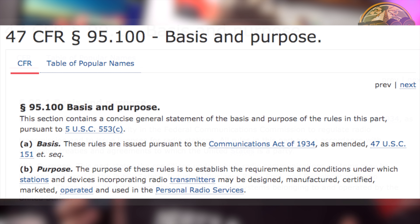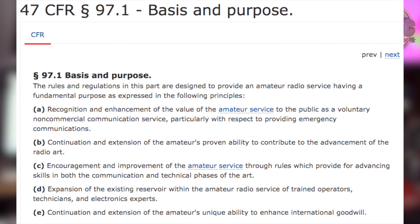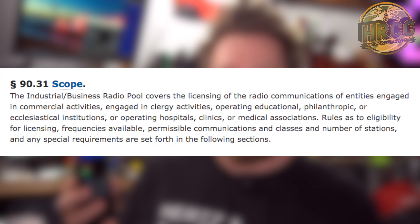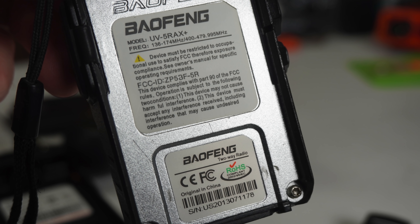Radios like this one are Part certified by the FCC. Part 90 includes land mobile radios. Part 95 is FRS and GMRS. Part 97 is amateur radio. The part documents are basically a big long document that explains the rules to get certified under that radio accreditation. Part 90 land mobile radio is used for business frequencies, like the drive-through at Wendy's or Walmart, where you pay the FCC to access a couple of frequencies and get your radios programmed to use them. Generally, Baofengs are Part 90 certified — remember that.